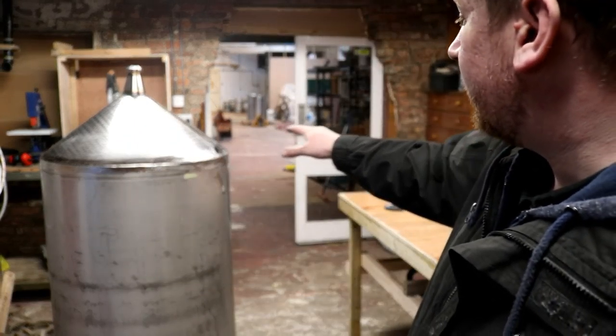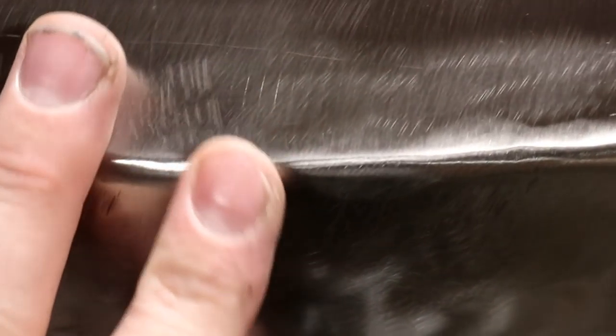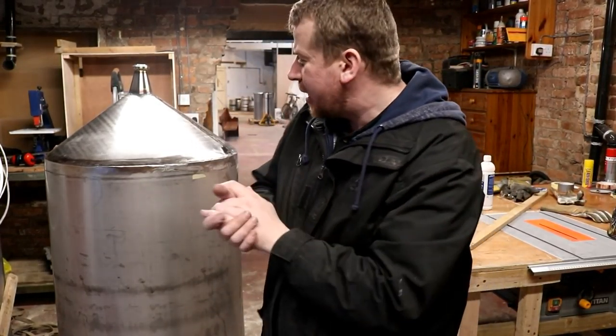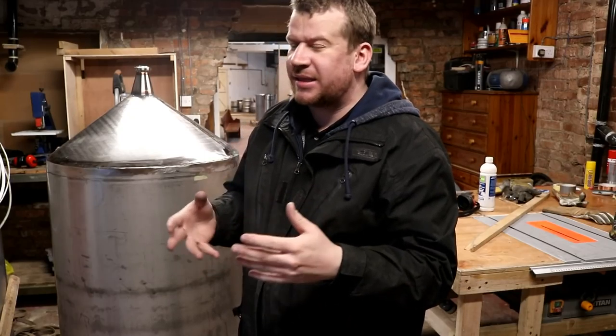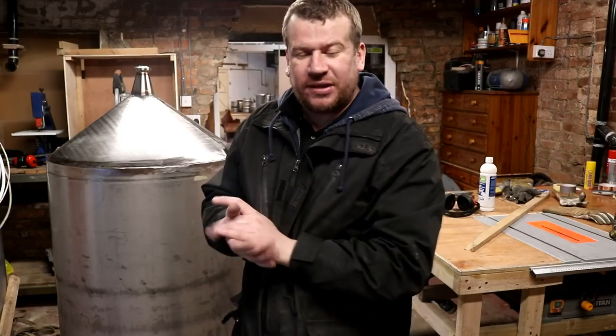I can show you how this seam has cleaned up - it's really quite sweet. I hit it with the grinder and just whacked a Scotch-Brite wheel over it, and you can see she's just perfectly smooth straight across the seam. I don't think I'm going to do much more in terms of finishing this steel off. The externals of these tanks will be clad, and if I need to polish the internals I'll do it after. I'm going to run some acid through them, and after the caustic and everything, to get them all cleaned up - I think that may passivate the surface and be good enough.